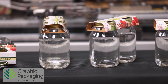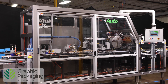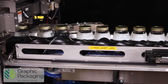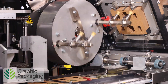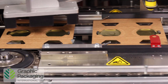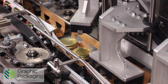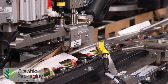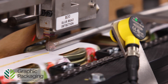Operating at speeds of up to 90 packs per minute, the applicator accommodates both plastic and glass bottles and jars in two-pack and optional three-pack configurations. As a screw conveyor spaces out jars of white vinegar, a vacuum system picks and stages flat paperboard carrier tops. The tops are then placed snugly on the jars before the machine folds and glues the sturdy paperboard, forming a solid carrier for the multipack. The pitched product's side transport chain and unique overhead clipping system create multipacks with great pack integrity, made for easy consumer use.